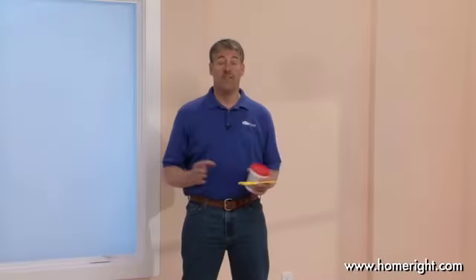Before you begin painting, you're going to want to prepare your walls so the paint will adhere properly. Proper preparation is the key to a great, long-lasting paint job. All you need to do is take a bucket of water and TSP or a phosphate-free alternative product to wash the walls — starting from the bottom up is the easiest. If you have any special concerns about the walls such as crayon stains, marks, or anything else, consult a paint retailer.